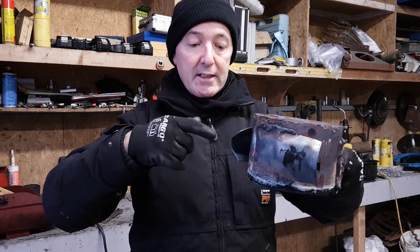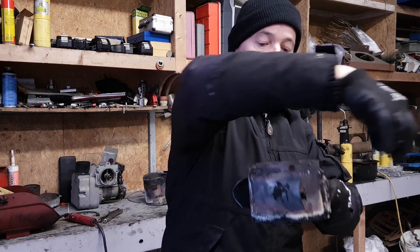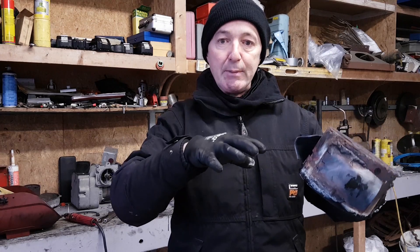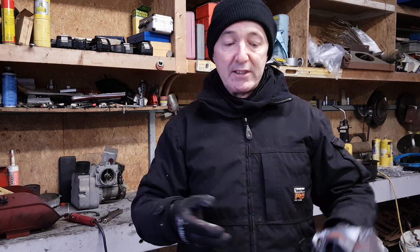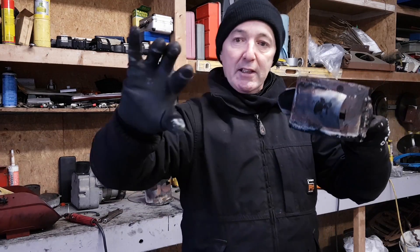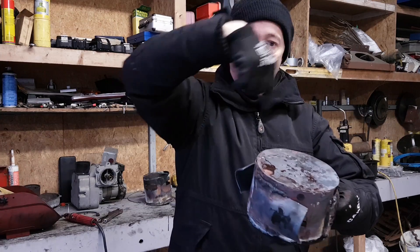I want to show you how I did it. I've welded these things on. These things are directional - directors, if you like, for the air. So the air comes up through the bottom and gets blown out the side in an anti-clockwise direction. That's the plan. The air goes that way. Hopefully it increases how the air is mixed within the burner unit, and if that happens I get a bit more efficiency. As it happens, it works really well. So I'm trying to make this unit work with both forced air - I've got a big fan - I drive air in through here and it squirts or shoots air through the sides.